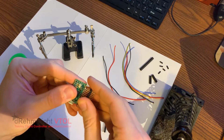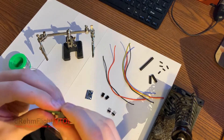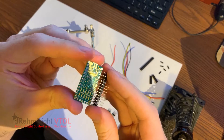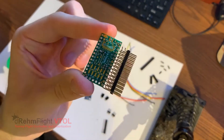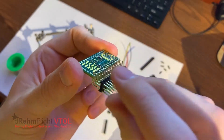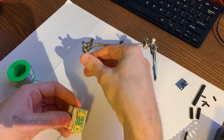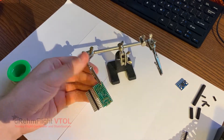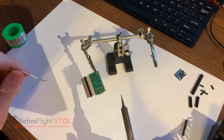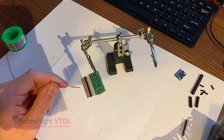This is actually an old Teensy that I had to desolder, so I'm having a little bit of trouble getting the pins in the board. If you have a fresh board, these will slide right in no problem. You just need to get creative and figure out a way to pin those in place while you solder the first few pins. One way I like to do is use a little piece of masking tape to hold it in place until you can get the first two or three pins soldered, and then that whole rail is going to be pinned in place to finish off the rest of the soldering.